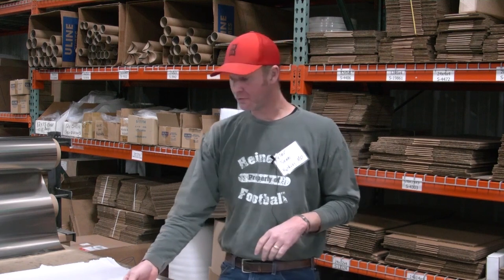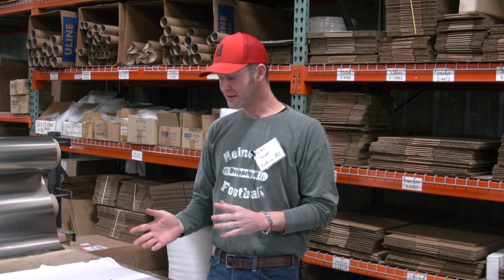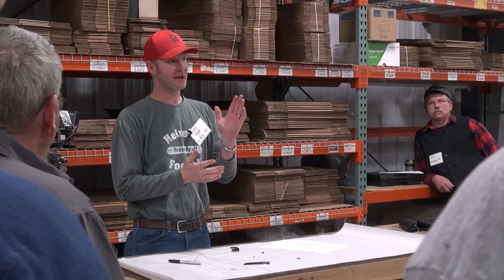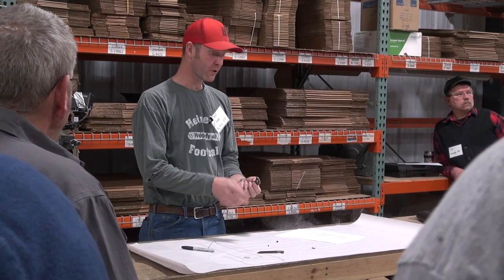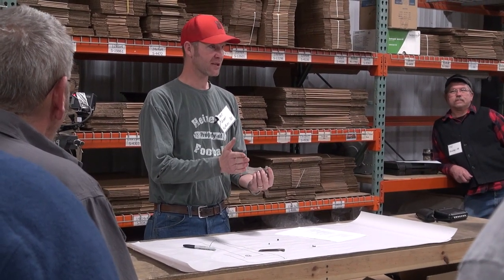So once you drill for your detent, put your knife back together and check your detent. See if you like it or not. And there are ways to get a stronger detent without making more force on your lock bar. But before you get your blade put together, I got ahead of myself: bend your lock bar. It's time to bend the lock bar.